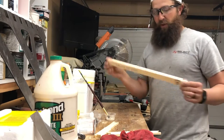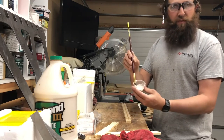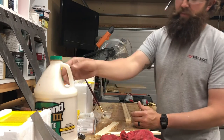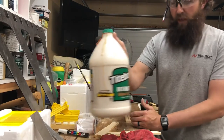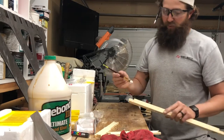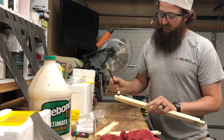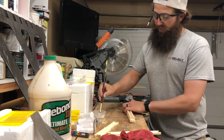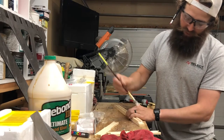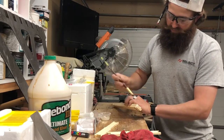The way we like to do it, you start with the top bar down. I use my plastic souffle cup as my glue container. Like great-grandpa always told me, only use Titebond 3, which we do. I've just got an old paintbrush. I just glob it on heavy on the underside and on both sides of the top bar. If it's not squeezing out, you didn't put enough — so I put way more than I think I need.